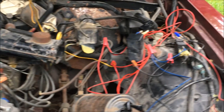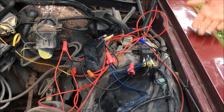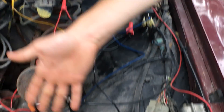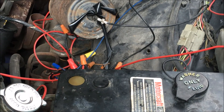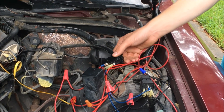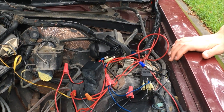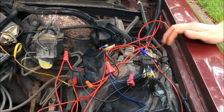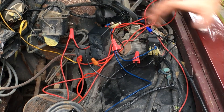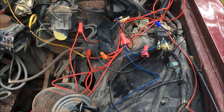To begin with, the hybrid system is controlled by — although it's messy — these three relays down in the bottom here, this one relay, and this switch. This is a vacuum switch; it tells the system when the engine's running based on vacuum. This is the oil pressure relay; it tells the system as well when the engine's running. So you've got two backups there to tell the system when the engine is running.